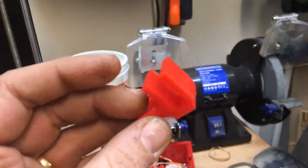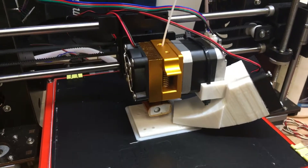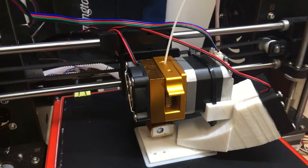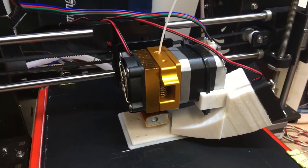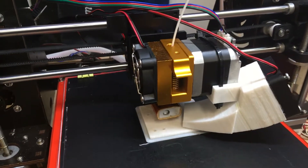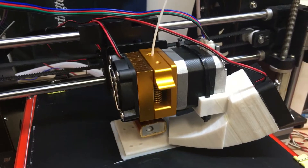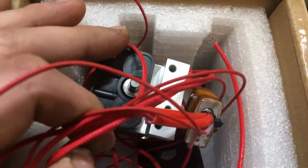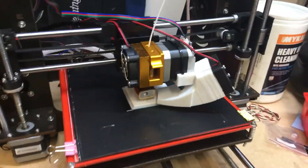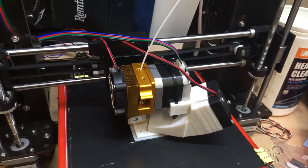The problem was that the extruder was under-extruding. It took me a while to figure out that the stepper was actually skipping, so it wasn't feeding properly, and I'd get dry spots — my builds would ultimately fail halfway through. I spent £20 on a new V8 extruder, which is better than the plastic one it comes with. But when I fitted this, the problem still remained, so I looked into turning up the driver voltages on the stepper motor.